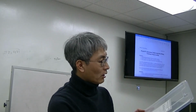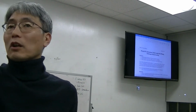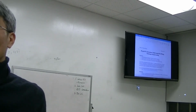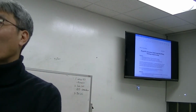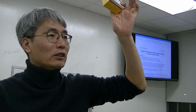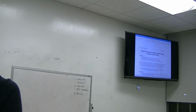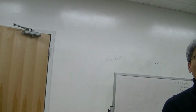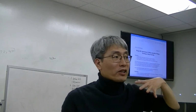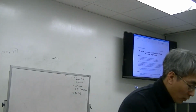And the next one is the power supply. If you already have experience using the Pi, from Pi 4 it requires 3 ampere power. Otherwise, sometimes if you run a heavy program, like deep learning and so on, it will power out. So this one is 3.5, the official power supply. Please use it. In case you want to use your own, check the ampere. Most of them for your cell phone are less than 3 ampere, so 2.5 or sometimes 1.5. Sometimes after you connect the car and Raspberry Pi, the battery is not strong enough. So to save the battery power, you can connect this one. Please keep this one to save your battery later.